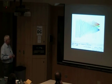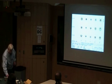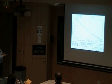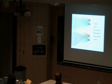Now, if you compare the function, they're more alike than different. I wouldn't say this is highly tuned up because I'm not a professional lens designer. MTF is slightly lower, but not bad. I would say that it competes very well as a design. For the other things, it's distinctly cheaper. It's a little bit smaller. You can see there side by side. Happens to be a little bit more telecentric, if that matters. That means that the light hits more directly perpendicular to the sensor surface. Distortion's a little better. It's easier to mount the thing. And the F number is a little bit lower. The beam's a little bit fatter there.